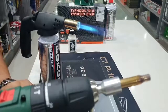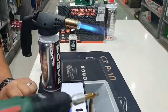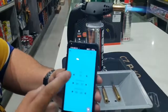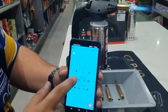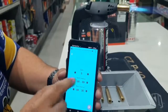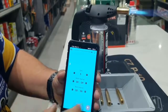So I am going to assume that 9 seconds will be on the dot for this batch of brass. I have got 5 cases here to anneal, so I am going to put the sets on 5. I have determined that our working interval is going to be 9 seconds. I have set that and I am going to put a rest interval of about 6 seconds in between.